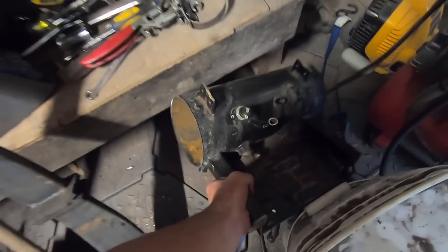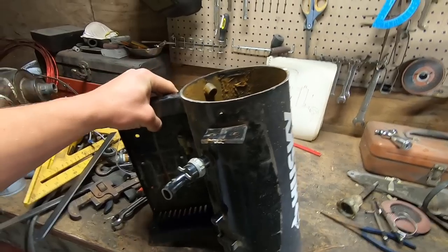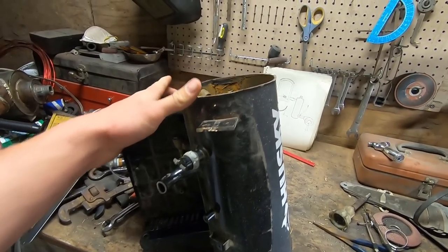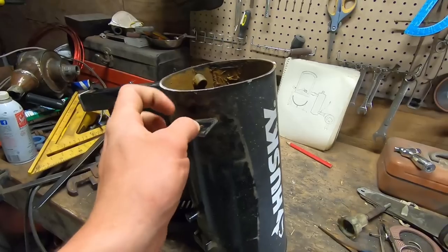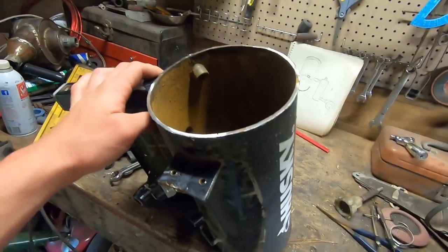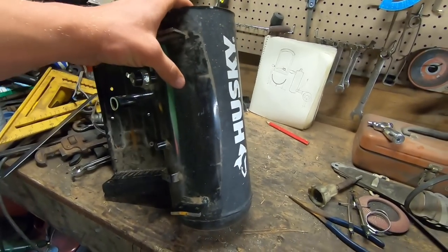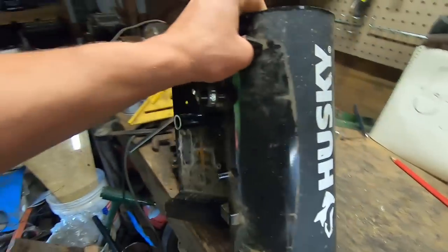So right over here on the floor by my fiberglass leaf spring, hint hint, I've got this old air compressor tank. Now the top is off, but I can weld it back on. And I think this is going to be my burn vessel. It doesn't need to be all that big, and in fact, I think it's better to have it undersized than oversized. Otherwise, we might be burning all of our fuel before it actually gets into the foundry itself, and I don't really want that. So I think this is a good size. This is about 6 inches in diameter, and I want to say it's probably about 18 inches tall. So I'm going to set that aside.